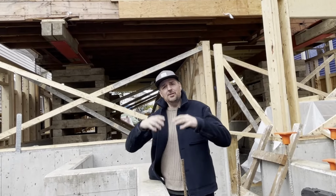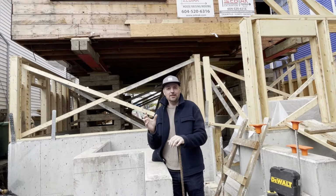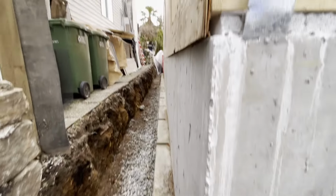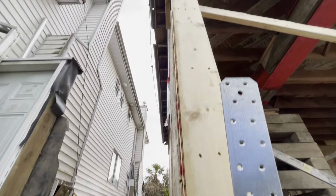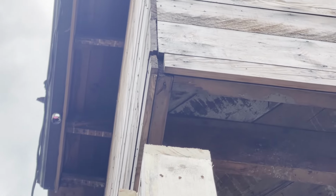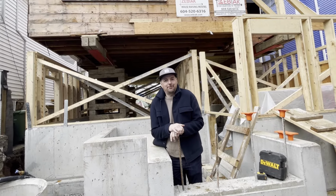Now, before the stucco and everything comes off the outside, you don't know exactly how big it's going to be. So we had our surveyor come and pin the corners for our foundation. And then when we started to form it, we realized that it was too far in from where the house was above it. This caused a lot of anxiety for me because once you pour the concrete, I mean, what are you going to do after that?